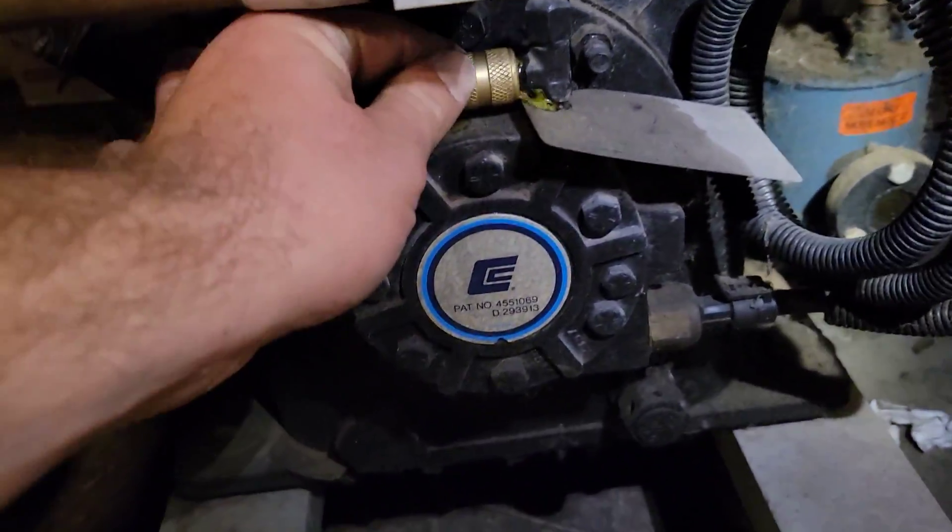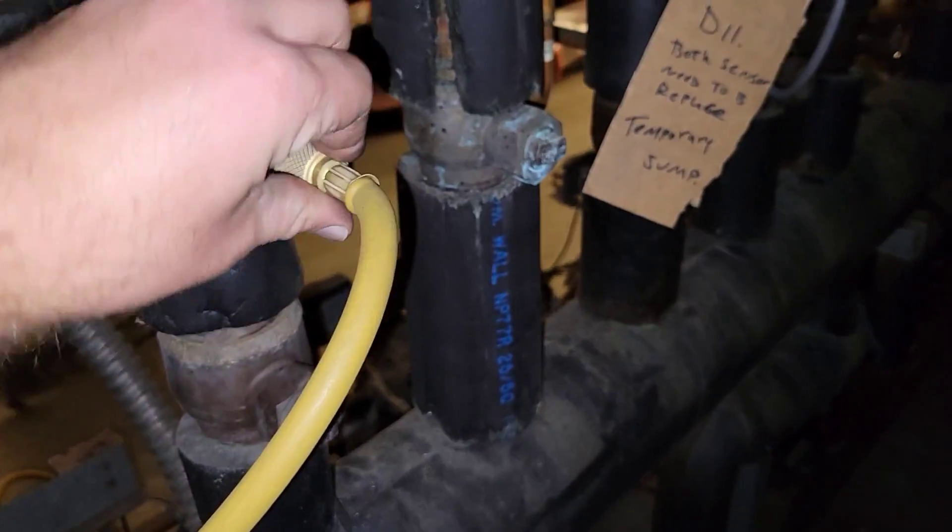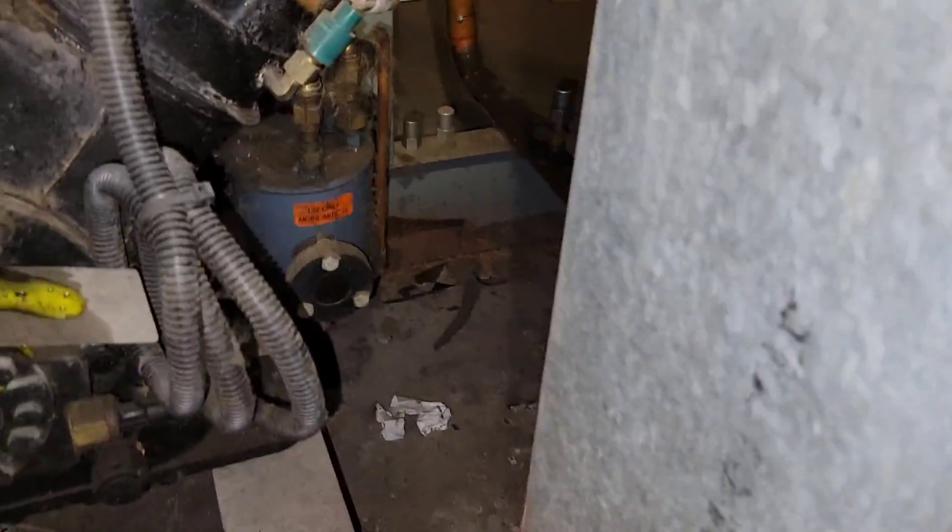On the front I'm hooking up to the oil line. The oil is being pumped out and going over into this liquid header. It might have been better to pump it in over there so it doesn't just trickle down to this compressor, but it is what it is. We're also putting a Schrader core removal tool in there to get this going. We're going to pump out all the oil until that oil reservoir is at least halfway or more.